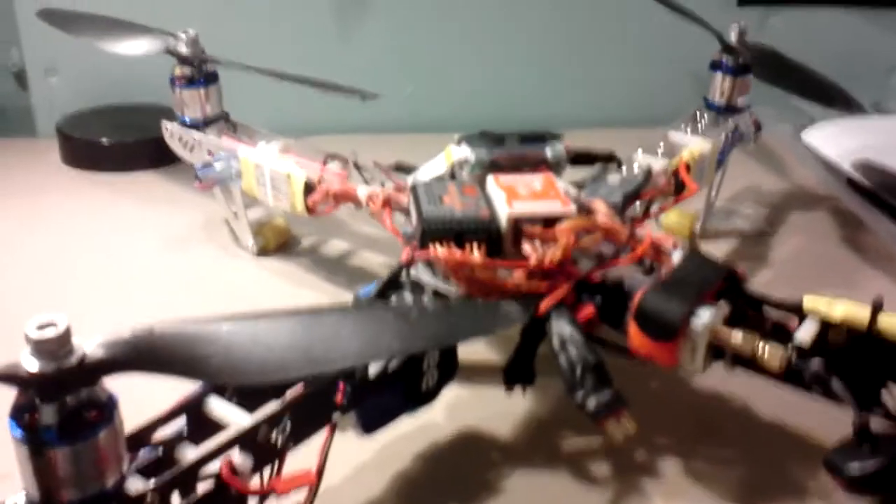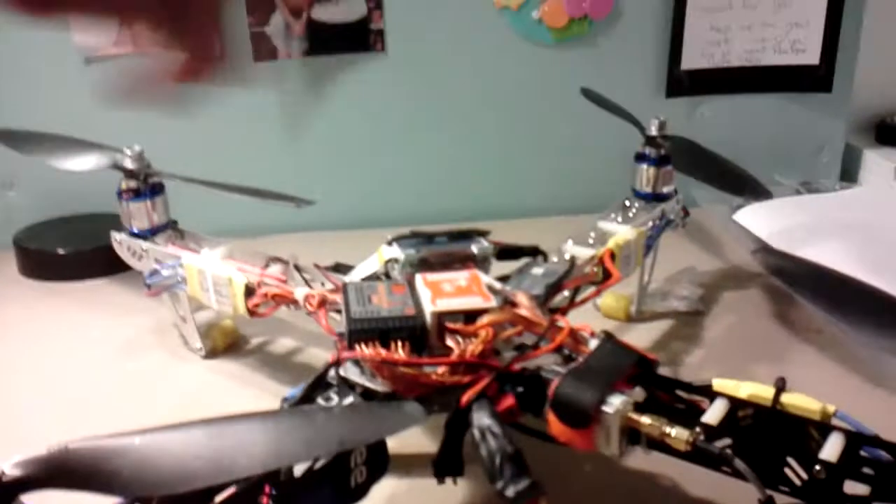It's losing power in flight to motors 2 and 3. I'm hoping it's not the ESC, but I guess that's the next step. On the power distributor — which is down there, it's a really small power distributor from Value Hobby — I put E6000 glue on it, from Michaels Crafts or Home Depot, to kind of make it more sturdy. I put it on top of all the ESCs that are soldered onto the power distributor, including the main.